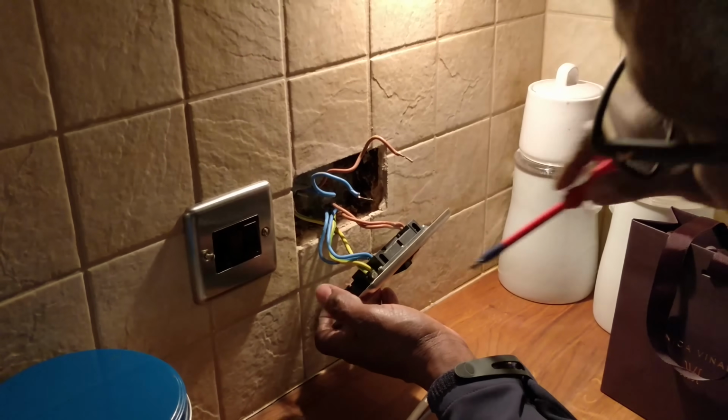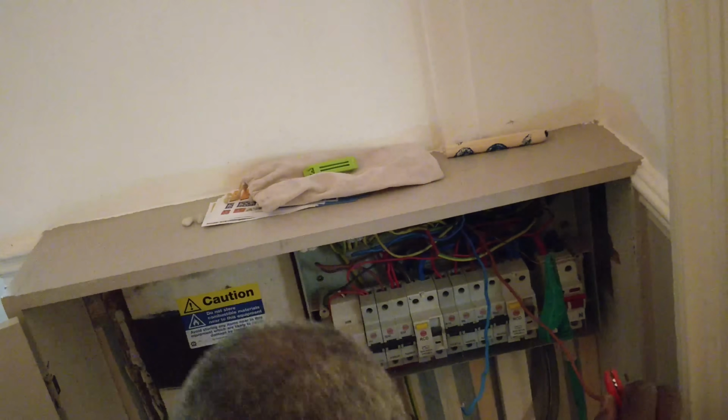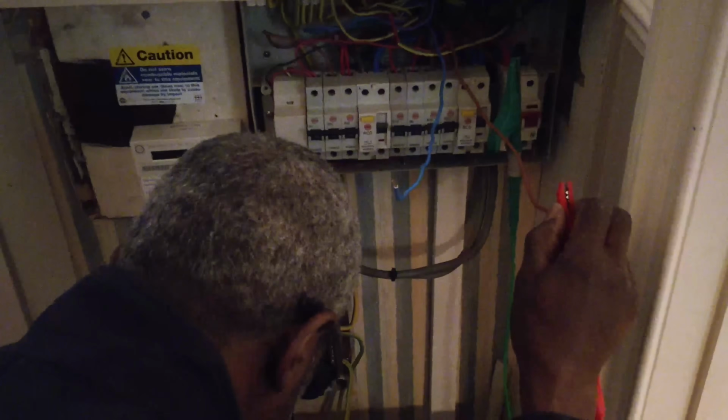Right, what I'm going to do. Right, so that's the garden lights. That could be the problem. I'm going to put another test on it now. Should we take these apart? See, I've disconnected that. You see that before we were getting 0.3 or something. So I've got a feeling that's the problem. Oh wow. Okay. Because even neutral to that, yeah. I think... the outside light. Let me show you, Olivia.